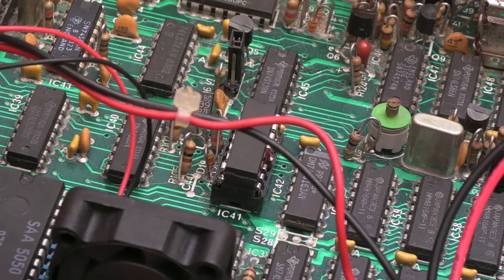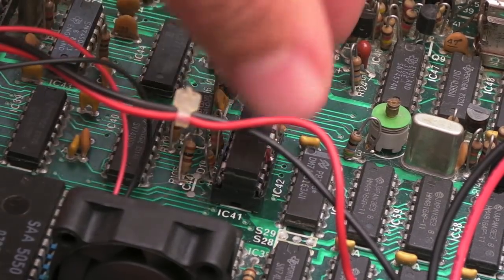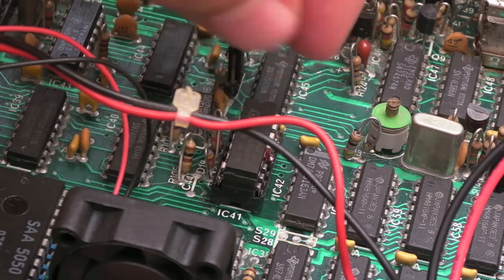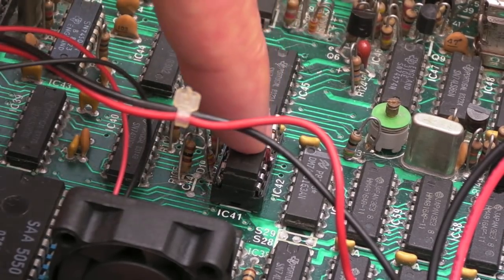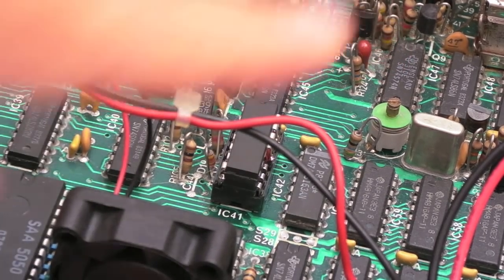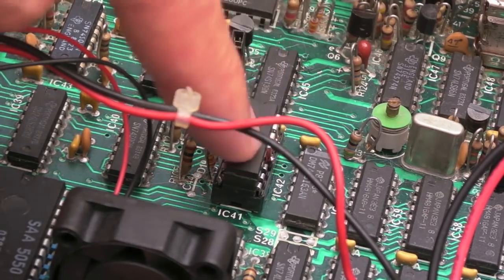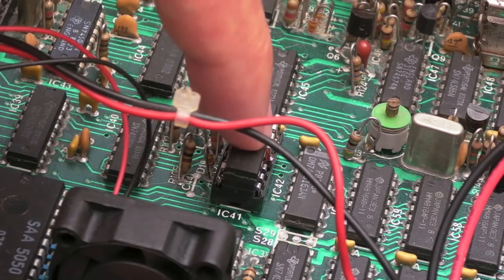But would I really want to leave that in there? I don't think so, because there are two other gates in that chip that we used elsewhere, and whilst we can't see any issues there, there could be, timing wise, it could be affecting clocks and all sorts of things. But the 74HCT is also perhaps the better chip to use when you do the piggyback model like this, rather than having an HC02 on the top just for that one gate, stick an HCT02 on there for that one gate, because that TTL output on that one gate going to the XOR gate, I think, which is the final stage for producing the C-sync signal, is going to be happier, if you like, having that TTL input there as it is now. That's the only question with this. On the output stage through the XOR gate there, the input is going to be coming from the CMOS gate here.